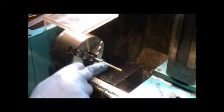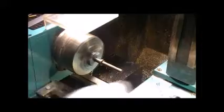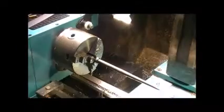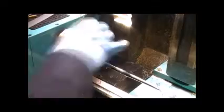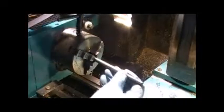We've got the spike in the lathe now, so we're just going to give it a good clean up. This looks like at one time it might have been knurled, so I might put that knurl back on before we install it into the handle. We're just going to give this a quick clean up and then we're ready for the next stage. Yeah, that definitely looks like a knurl on there, so I think we'll mount that back in and knurl it.